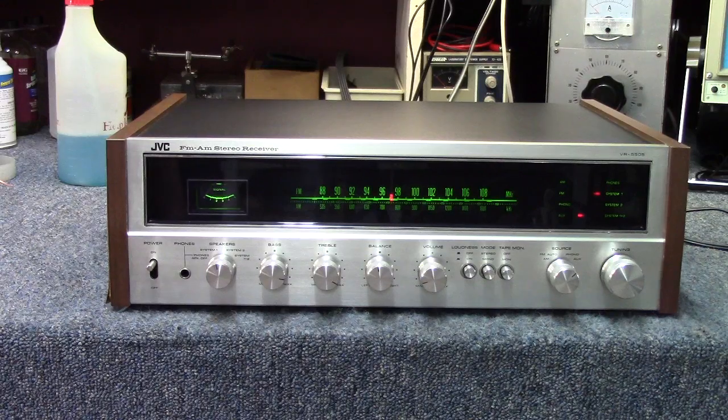And the only thing I would recommend to you over and beyond what I've done in this video is to replace all of the Hitachi transistors. You might can use the receiver and just kind of see if those start to become problematic, and if they don't give you issues, then you might want to let it ride. But if I was going to keep this for myself, I'd probably switch those out.